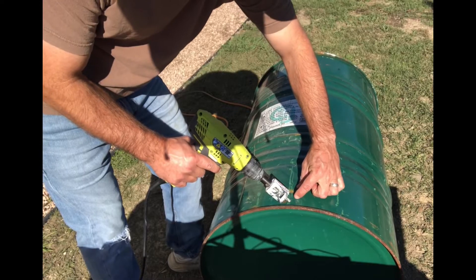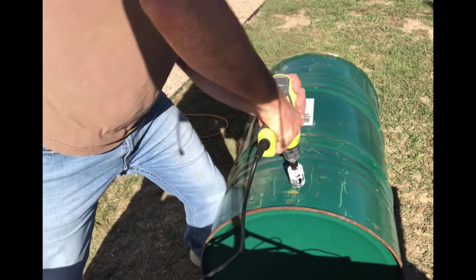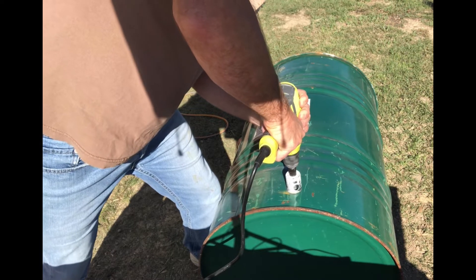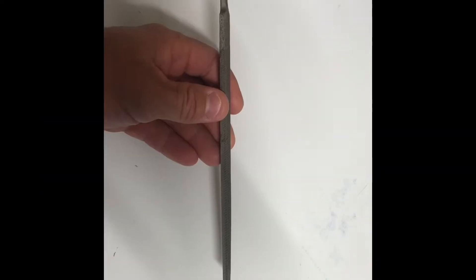This is a step-by-step on how to do it — it's very simple. This is going to be a head pressure system, not using any regulator or stepping down pressure from your house hose bib. It's just gravity fed, very simple. All the parts are in the description. To get started, there's a lip on the bottom of the drum — make sure you don't get too close to the bottom. Give yourself another inch or two above that, and drill right through with your hole saw. Be careful, it's going to heat up as you're spinning it.